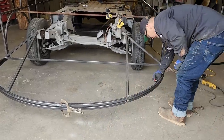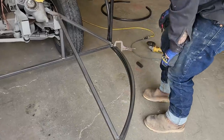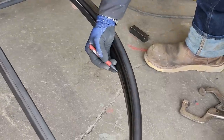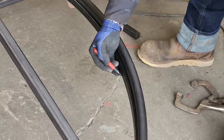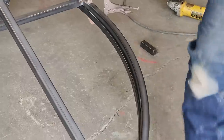So I'm going to relief it. I'm going to relief it in the center of the biggest. Mark that out. Now, are you not going to have to cut this in half for like a door here anyways? I'll relief it here. Just cut a few marks in it, I guess, where it needs to be relieved. Yeah, there's going to be a door in here, but I want to stud it up, make it.